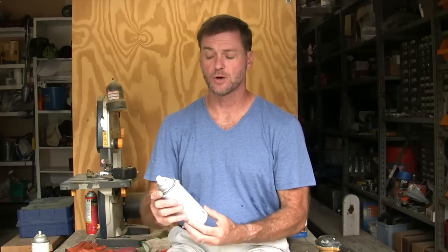One thing to remember is when you do come back to use it — whether it be a week, a month, or whatever later — shake it really well. Because as you recall, there's that sludge, the solids settling at the bottom. If you just pick it up right off the shelf and use it, you're going to suck those solids right into the tube, and it's too much for the orifice — the orifice is way too small for that. So shake it up, mix it really well, and that trick will work like a champ for you.